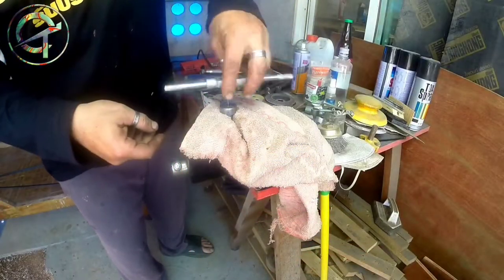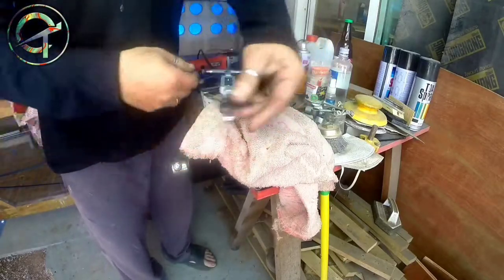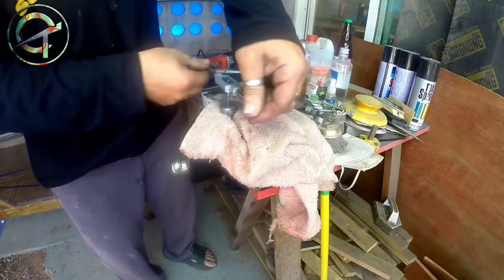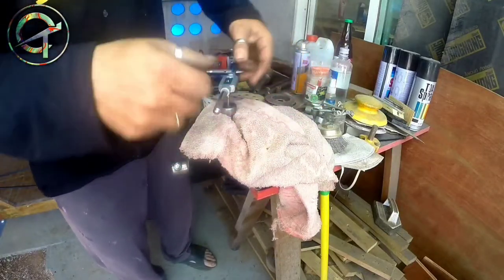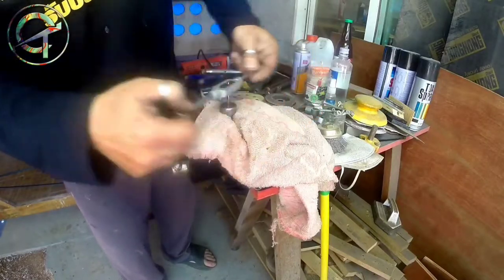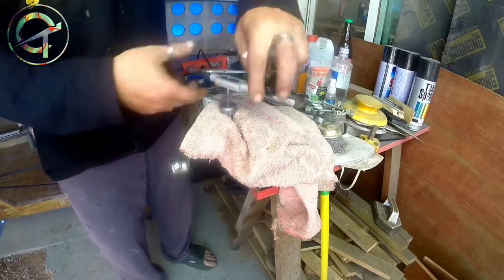Once the holes are drilled, I proceed with an M3 thread. Be careful, because an M3 thread cutter is really tiny. Move the tool clockwise, counterclockwise often, proceeding with caution, because it can easily snap.